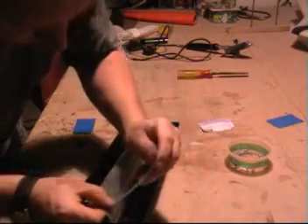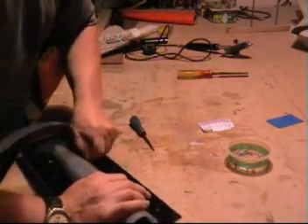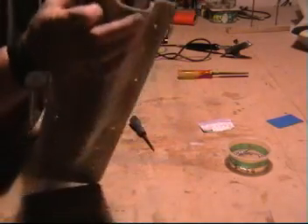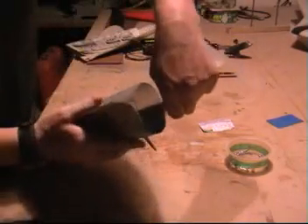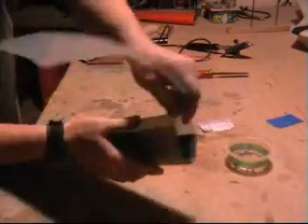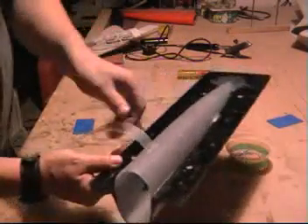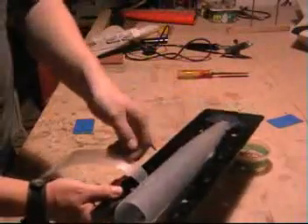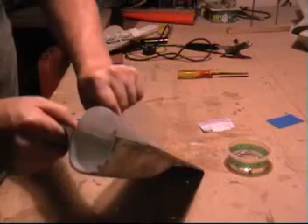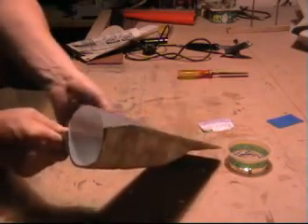Work our way around the top. It's amazing where you can poke this mylar into. If you've got a particularly obstinate mould, you can start at one side, just keep wiggling it, get it right round and up the other side of the mould, and then pull the two ends hard to get it out. Don't think we'll need to go that far on this one, but I'll show you anyway — just keep wiggling it gently back and forth and hopefully it should go all the way round.